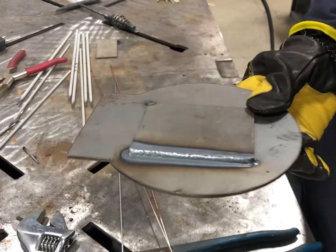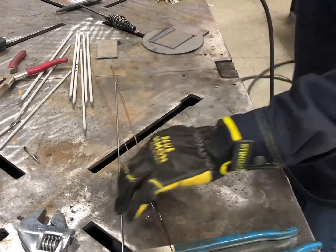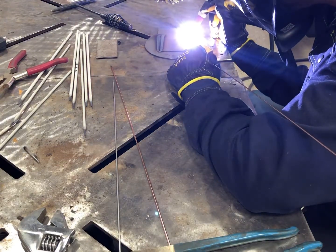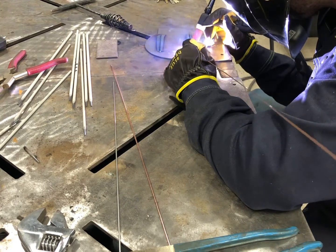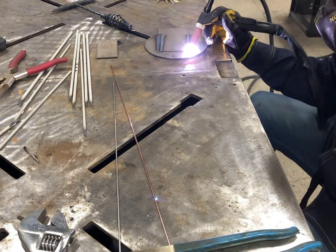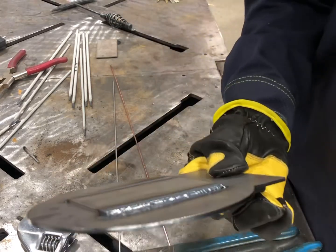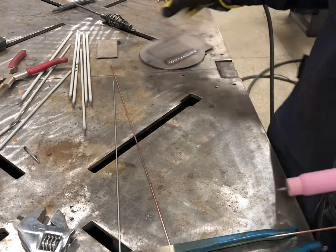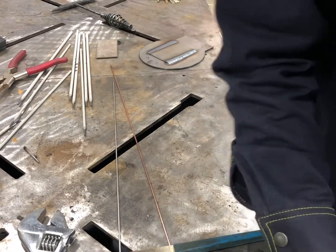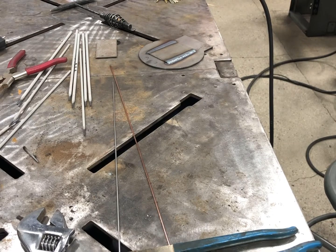A little light lay-wire pulse at the lower setting. Now we'll flip that switch and do higher pulses per second. A little bit of downslope on that — it was a lot faster than I actually thought. You could hear it — really quiet. The slow pulse had more of a ripple pattern. The high pulse was so much faster — I thought I'd see a little bit more than that, but it's really high frequency and that has some great benefits.